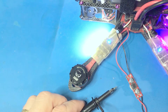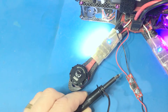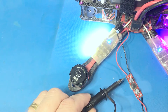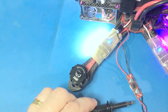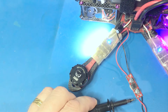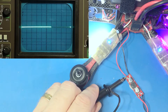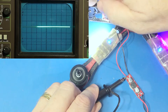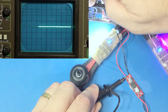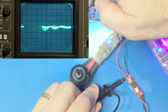Here is our copter from the previous video. All the ESCs now have an ESR capacitor attached to them. We've got this LC filter connected to the LiPo battery and we're going to monitor the signal at the entry point to the LC filter and at the exit from the LC filter. Let's check the signal coming into the filter — tap the aircraft and you can see the noise pattern we had earlier. We're looking at around about one volt, and notice the high frequency component, that shaded area on the graph.